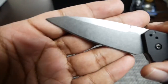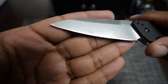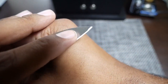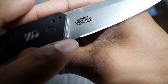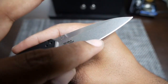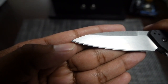So this is the Kershaw knife. Do you see what looks like a wire edge all the way along that bevel, or for the most part all the way along that bevel? Let me flip it to the other side. Look right back here — it's very pronounced back here. Look at the tip of the knife up here, and then down here. You can see the difference between the factory bevel and the bevel that was added by their testing machine. You can see it really clearly there — the bevel is very wavy. I noticed it again on the tip, and you can see that wire edge I was talking about.